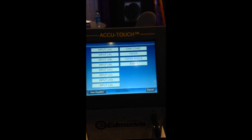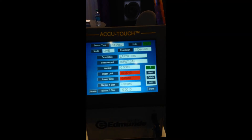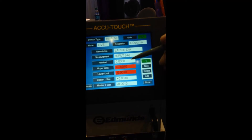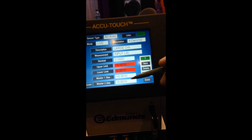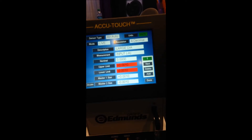The measurement I'm going to use is input number A-, so you simply select A- as the input. From there, we identify the spec limits of where we want to measure and we input the actual calibrated master sizes of the masters that are going to be used for the measurement.